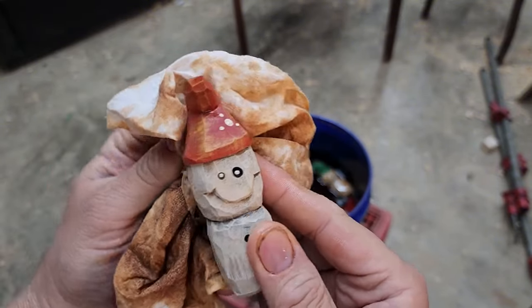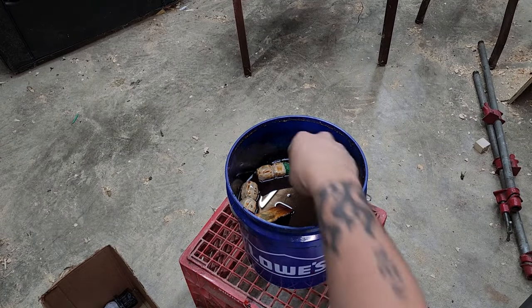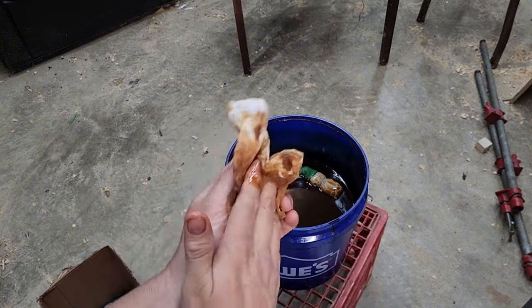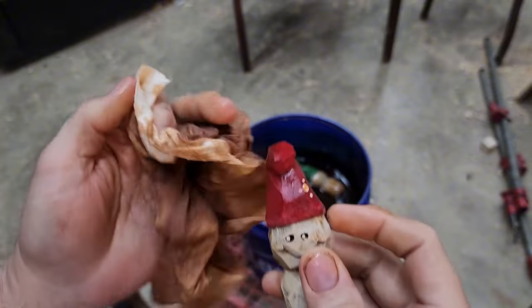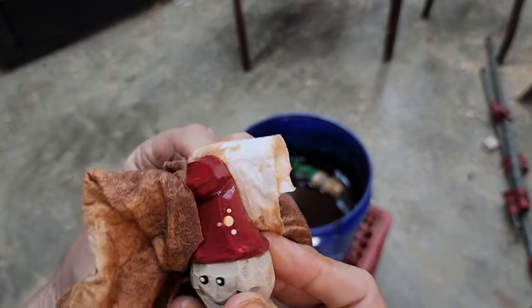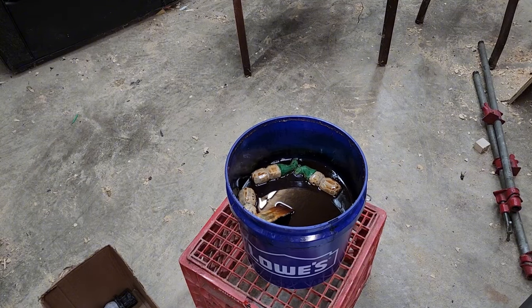This is how I apply it — just wiping it all off. All these towels when I'm done with them I put in the barbecue pit outside. That way, if they do catch fire, they'll catch fire in a safe environment and not cause a problem. Over the past year, only one time have I gone out there and noticed they had all burned up and caught fire — so definitely a concern you should have. Just make sure you're not storing those towels inside your house and you shouldn't have an issue.